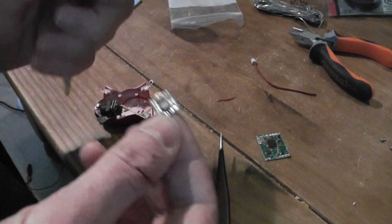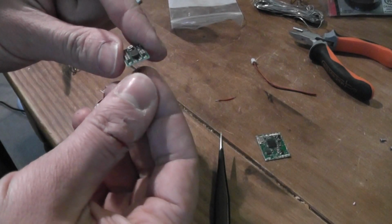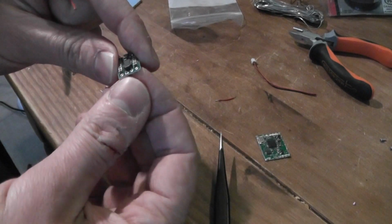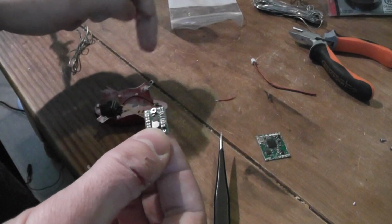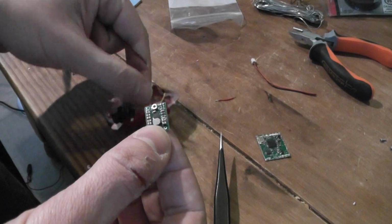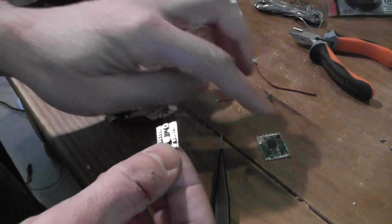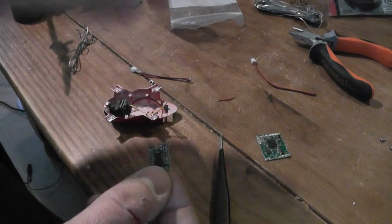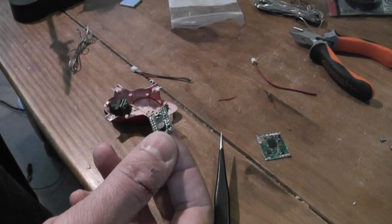So next goal is to first install this tiny wire, and after why not solder the cable, and at the end the camera. Well, before soldering to the VTX, I will also tune the voltage regulator to 3.85 volts.